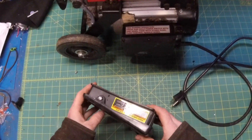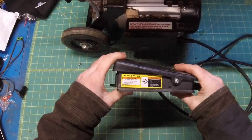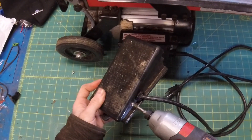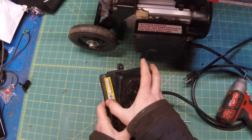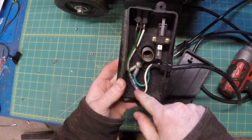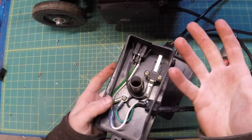So this is what we're going to use to make it work without our hands. This is one of those things I saw in the store years ago and thought, oh, that's cheap and I have a coupon. It's a 15 amp foot switch — I thought I might use it for a saw or a sewing machine. It's been laying around, dirty and dusty, and we're finally going to give it a home. Let's take it apart and make sure it's actually safe. It looks good: line cord in, properly grounded, insulated connectors, soldered onto the receptacle, and a micro switch which I'm sure is rated for enough current.